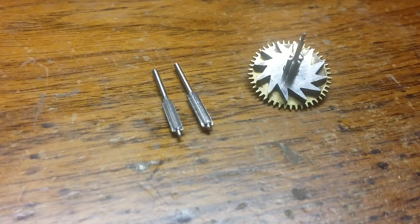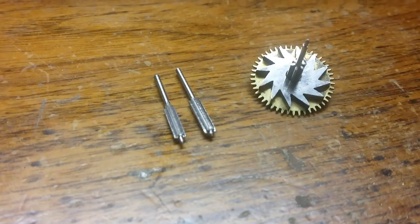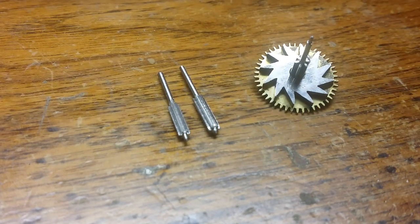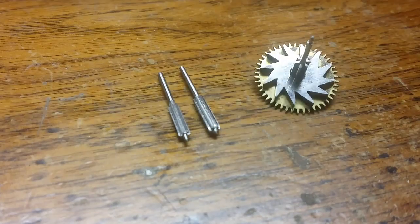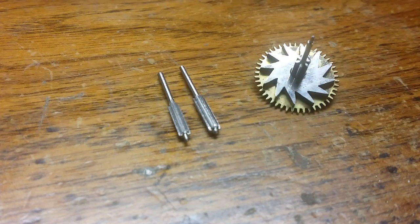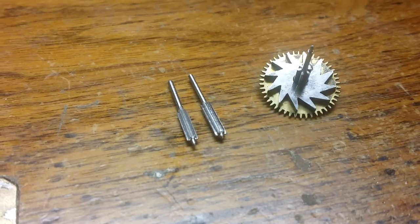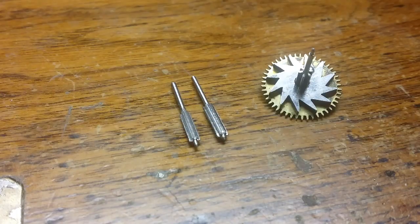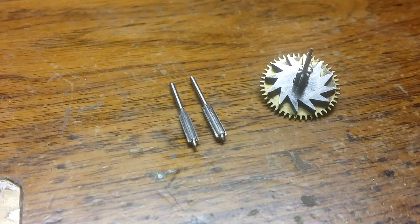So what I'm going to do in my next video, instead of trying a third time to make a pinion, is design and make a cutter, a pinion cutter that will be appropriately sized and have all the right dimensions and profiles. This is kind of the least preferred way that I want to go about this, because obviously it's time consuming. It's time consuming in the respect that I've already made 2 attempts at this part, but it's also time consuming in that I have to make the tool that makes the part now.